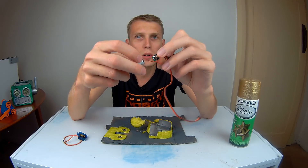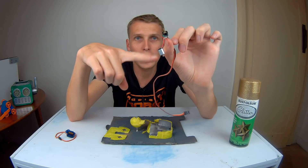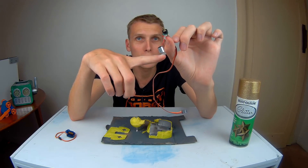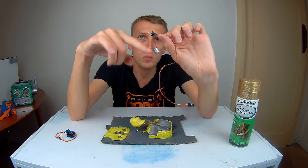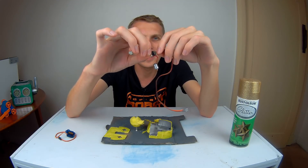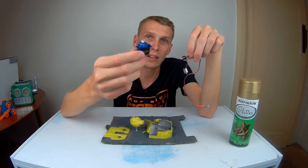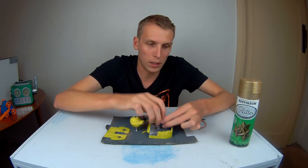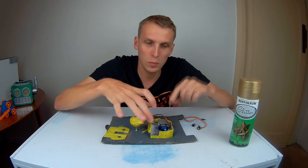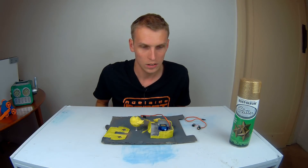What we're going to do instead is cut the red wires in a brand new servo and add our own H-bridge, so we get this motor moving at 7.2 volts — or whatever the full voltage rail of a fully charged LiPo is. That means we're going to jump the voltage up and therefore jump the speed up, which hopefully means the hammerhead will move a little bit faster. I'm still not expecting this to do huge amounts of damage — realistically this is just an experiment to see if I can increase the speed on a really cheap servo like this. Once we've done that, we'll mount it all up, attach the hammerhead, attach some wheels, bolt it all together, and it will be ready for a test run.